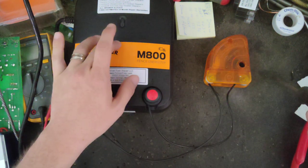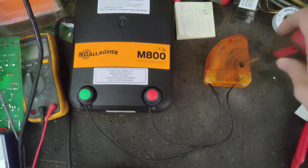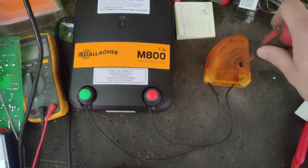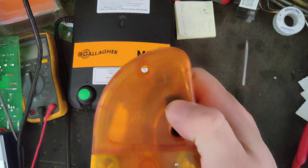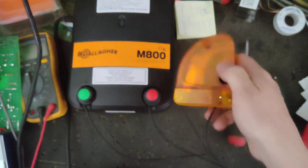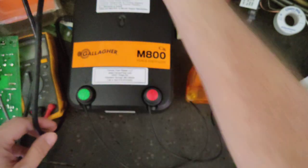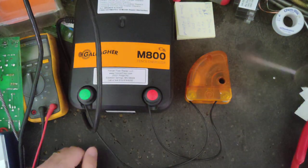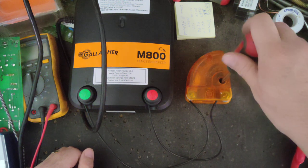And then before you plug the unit in, or if it's a battery powered one, before you hook the battery up, turn that gap all the way to the right, the screw all the way to the right, which points that little lever at 12 o'clock, straight up and down. Then you go back to the unit, turn it on, plug it in, hook it to a battery, however it powers up. Go back to the diverter, use a flat screwdriver or Phillips, either one will work.